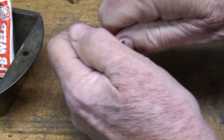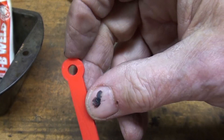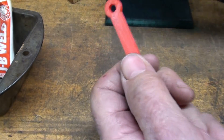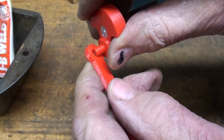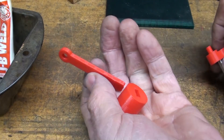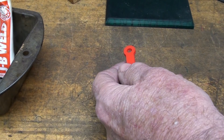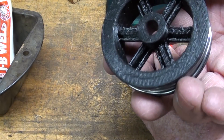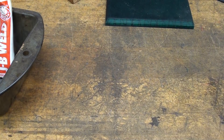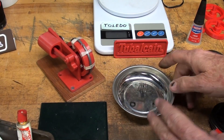This material does not file well at all. The piston can then be pressed in like that. I'm going to have to file it just a little bit — I don't want to bang on it here because there's some hollow there and I know that'll probably break. It's a good fit. I used a 5/16 reamer to clean out the cylinder bore.